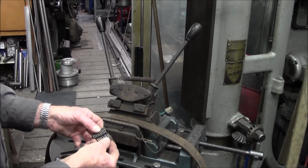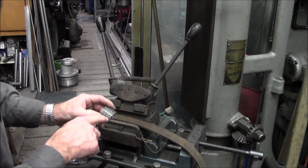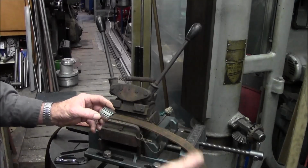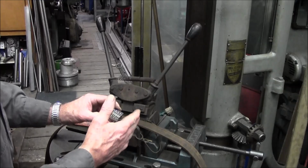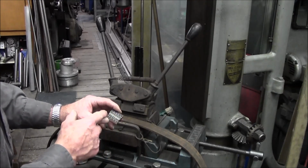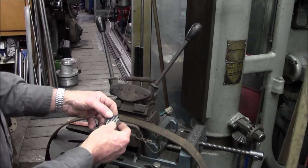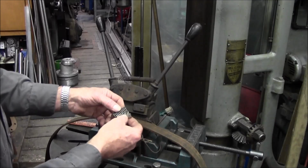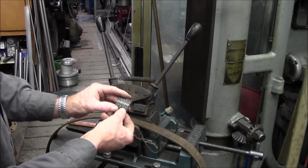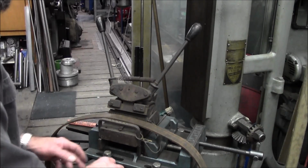And we can kind of put our two belts together, because we really want to look at how that was made up. And I really don't like to get a staple real close to the edge. I'd rather have one less staple than I actually think should fit there, to kind of plan that out. But if you go equal and you have one more than the other one does, you can pretty well center each one of them up in your belt and you'll be pretty well straight line. At least in my experience doing it.